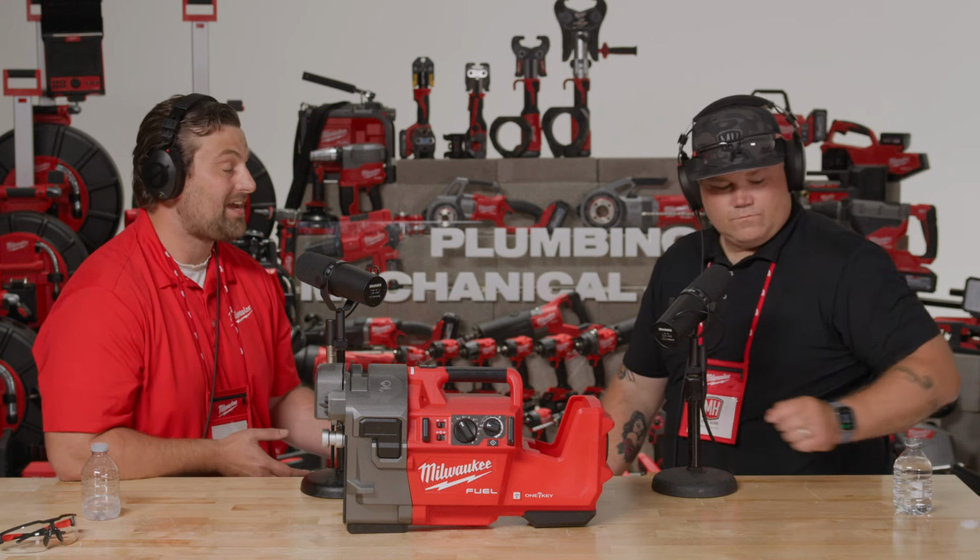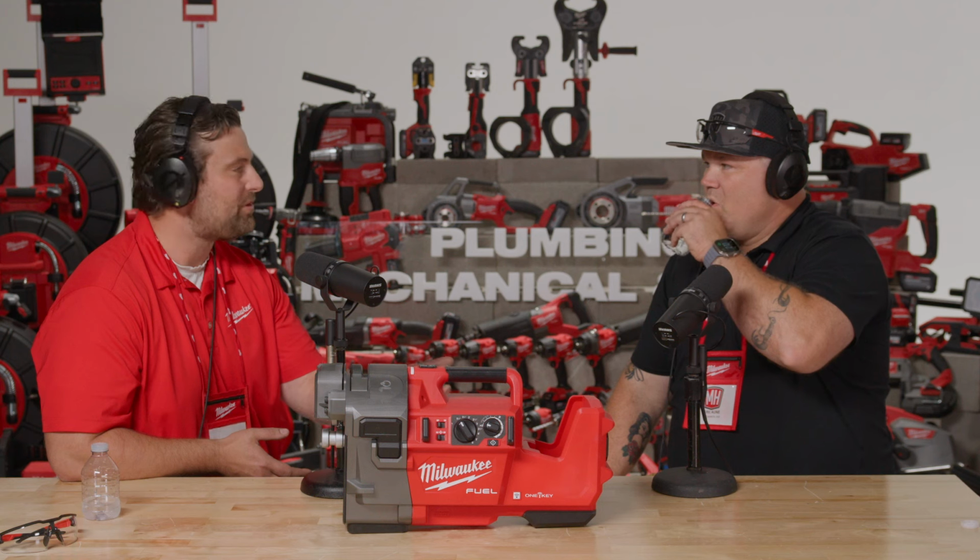We saw these big power drive systems set up, and moving those into a transportation mode is very difficult. We also saw a lot of guys using these big threaders that were only grooving that day. So they're hauling this huge machine out, or having to set up in a location that's all the way on the other side of the job site. And they're walking pipe and taking measurements on each side, taking all these unnecessary steps back and forth.